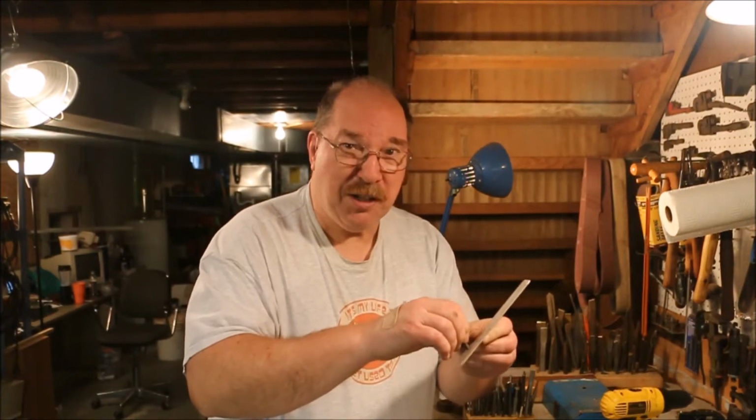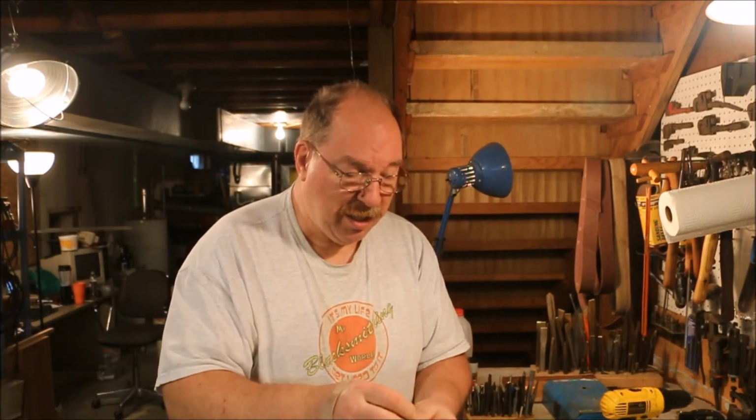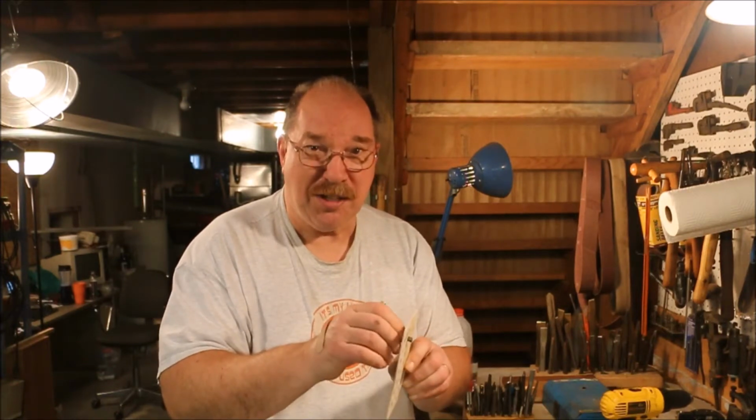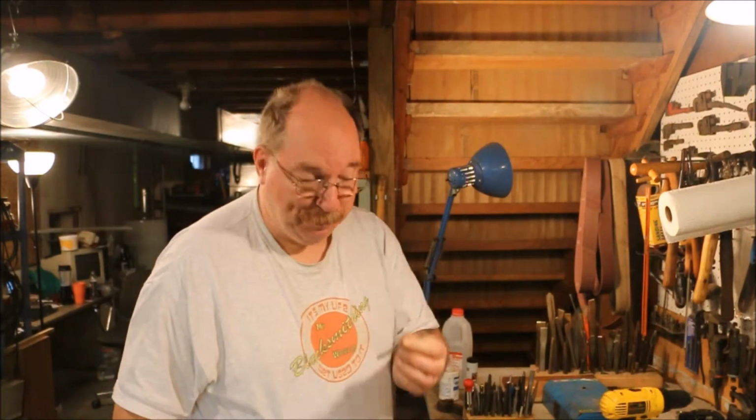They won't quite fit into a 1/4 inch hole. They're a little snug in a 17/64. They'll slip right through a 9/32. So what I want to do is use a 9/32 drill to punch the holes a little bit bigger so that I can use my rivets. And I just happen to have a couple dozen of these laying around.